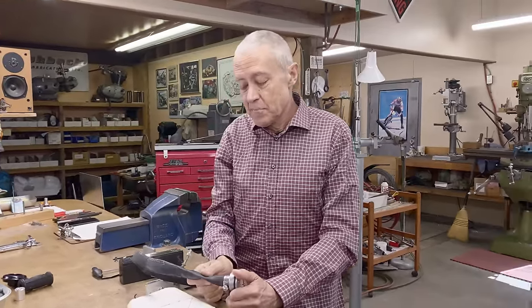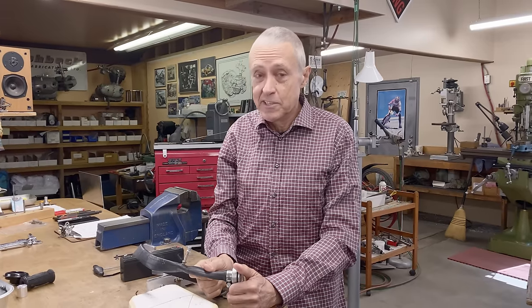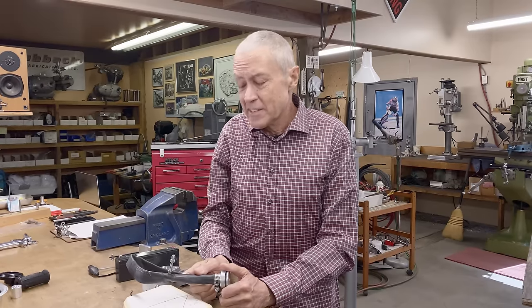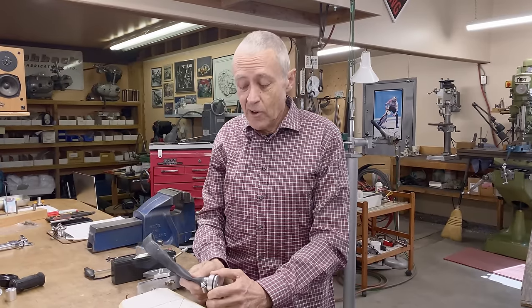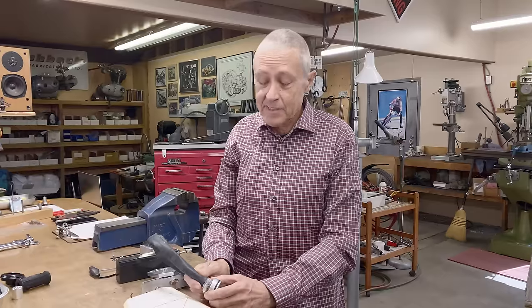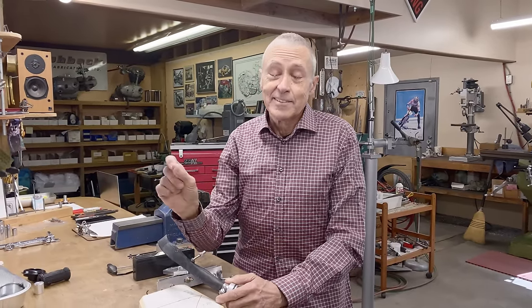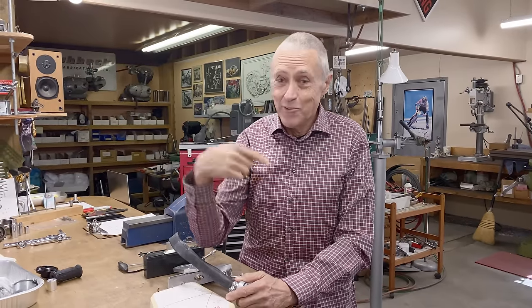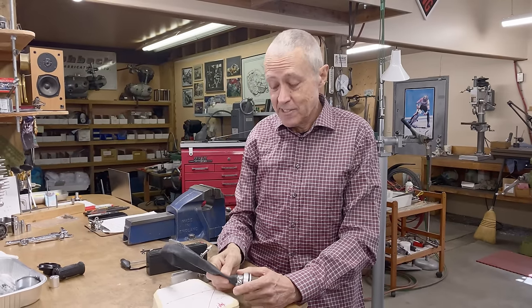There was some discussion of whether we should braze it or TIG weld it, and we decided to go for TIG welding. I think that was the smart choice, because if it was brazing, there would have been a lot more heat over a larger area and more paint would have been lost. I did some TIG welding, then we checked it and the crack spread. I TIG welded that and then the crack went over here. It was back and forth from the bench to the TIG welding station, but we got it fixed.